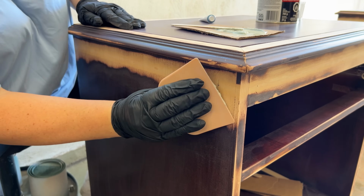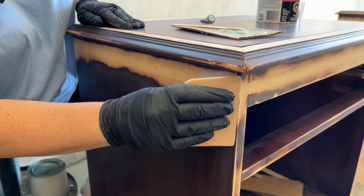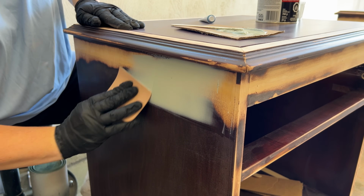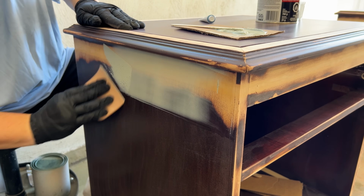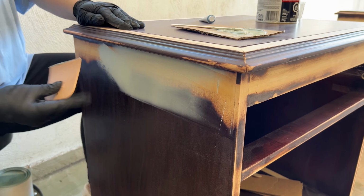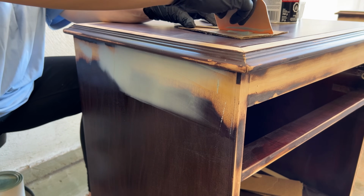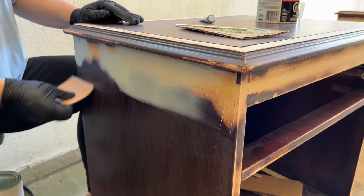I smoothed this around all of those heavily sanded parts to fill in the nail holes from the trim, any spots where I was missing veneer, and the epoxy in this is actually going to harden up the bare wood a bit, so it's a closer texture to the wood around it that's still got that factory finish on it.